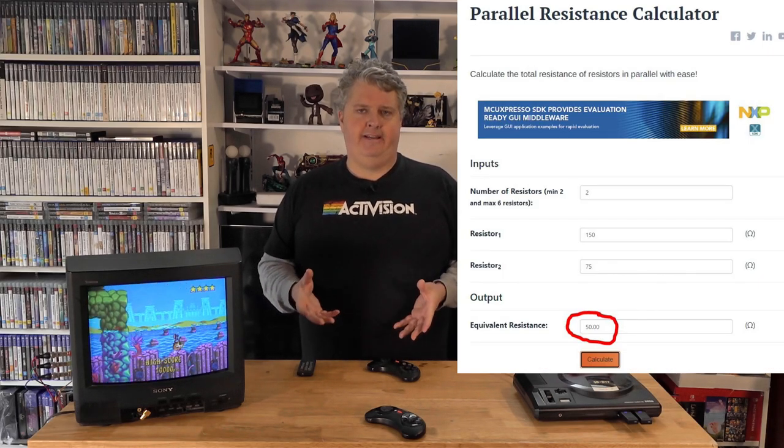You can check what those resistors are, and whatever they are, you can work out what resistors you need to put on your RGB terminations at your RCAs on the actual termination where your console plugs in. If you don't want to pull those resistors off, I'll let you know what they were — those resistors were actually 150 ohm surface mount resistors.